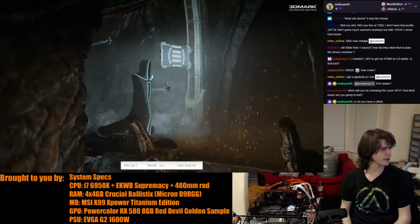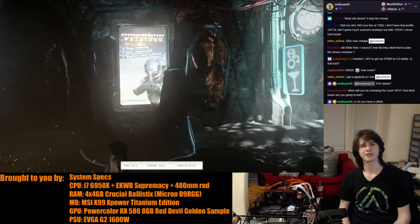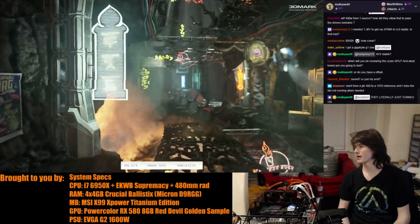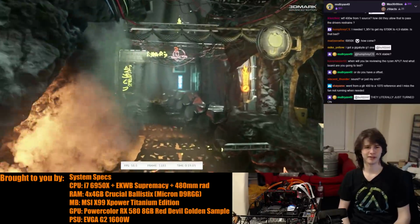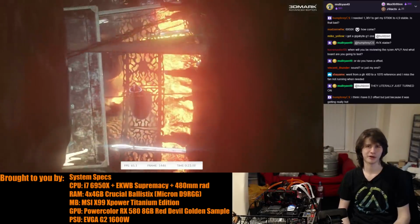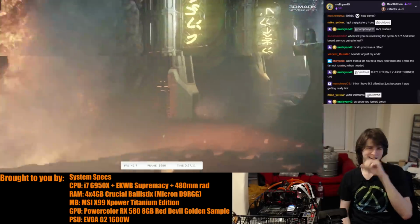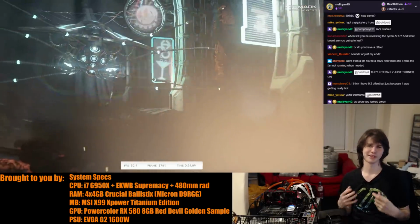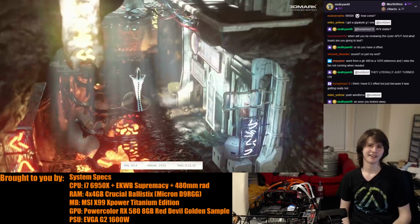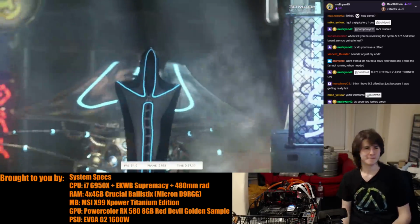When will you be reviewing the Ryzen APU, and what board are you going to test it on? First of all, I don't do gaming performance reviews, okay? Second of all, the main reason why I wanted that APU is to mess around with how far I can get the Firestrike score on a 2400G. That's literally all I care about. Because it's an APU, it should be really, really memory sensitive, and that just sounds fun to me. I get to run 3D benchmarks where the RAM overclocking actually matters.